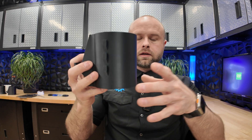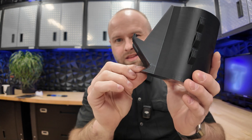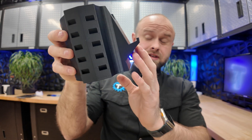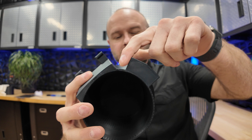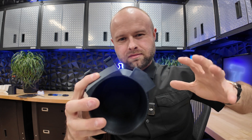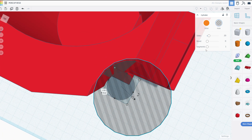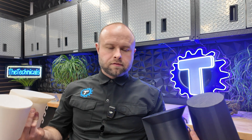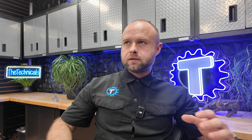For version four, I removed the wide cone base in lieu of a foot underneath the phone stand portion. It was a lot thinner and chintzier than I'd like, so I removed that, made the overhang a little less shallow, and brought it straight down. That removed the steep overhang, allowing me to print it without supports whatsoever. I also remembered that aesthetics matter — the void between the phone stand and the USB tower gave me a little agita. So I went back into Tinkercad, filled the majority of the void, then used Fusion to chamfer and smooth out the remainder. I gave all the edges a fillet and arrived at what I consider to be, objectively, the most ingenious thing ever designed. I need to see things in real life and not on a screen — which, oddly enough, is the same pickup line that worked on my wife.